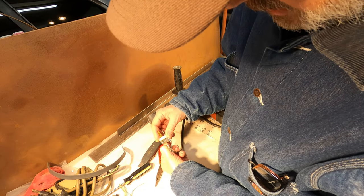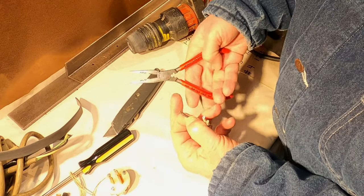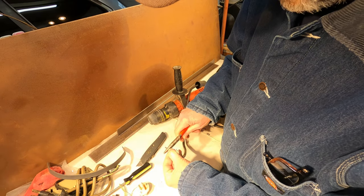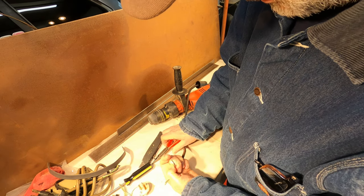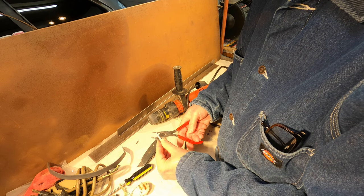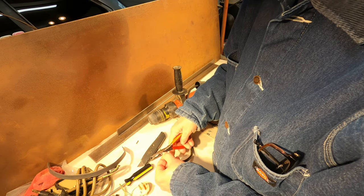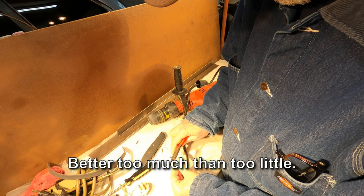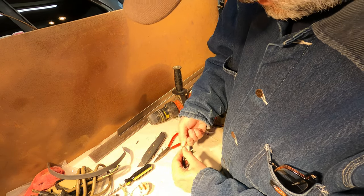Just put that in there, mark the depth, and that's where you're going to strip it to. These electrician's pliers have three stripping holes in there — one for 12, 14, and 16 gauge. These are 16 gauge wires so I'm going to use the 16 gauge stripper built into these pliers. I'm not happy because it took off some of the strands, so this is going to be a do-over. Cut them even, try again — I'll try the 14 gauge stripper. There, that's better. Didn't take any of the strands with it that time.